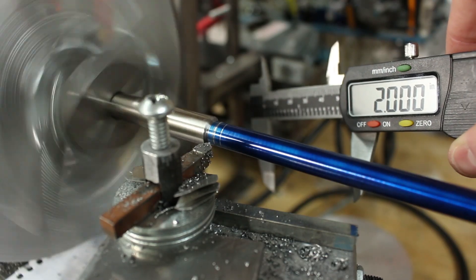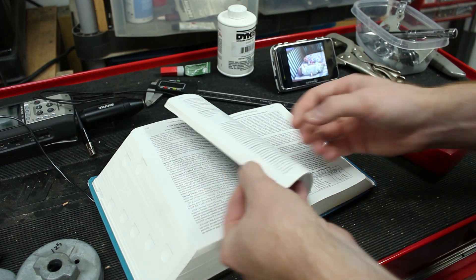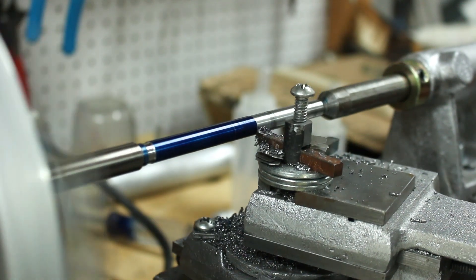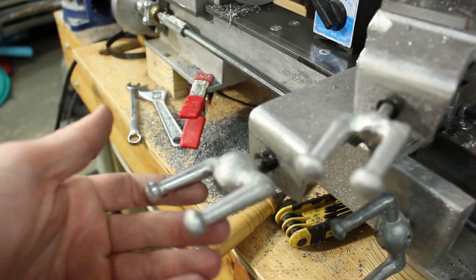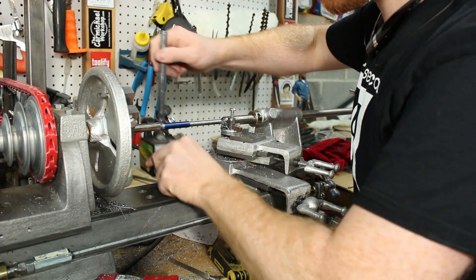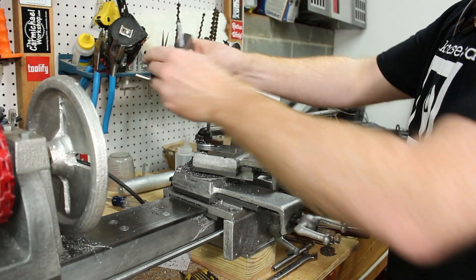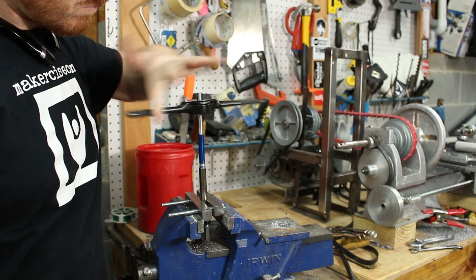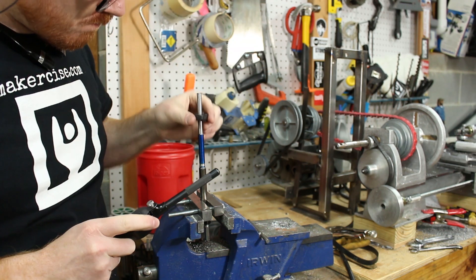This time I decided to turn down a portion of the rod so that my die would be aligned for cutting the threads on the end part. I looked up the minor diameter in Machinery's Handbook and then I turned down the rod to that diameter. After I turned down the rod I tried starting the die by hand but it was a little tight. I put it in the vise and got ready to tap it with the wrench, and once I got it down away from the end a little bit I noticed that it seemed to be the right diameter.